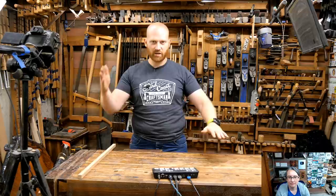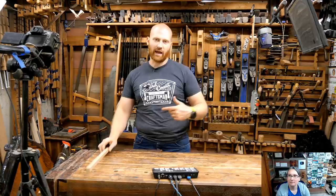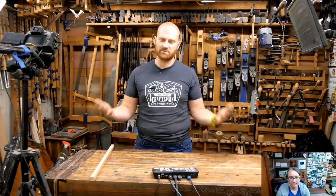And then you put stickers on top of the wood, and then you put wood on top of that, and stickers on top of that wood, and wood on that. That way you separate all your wood by the thickness of your sticker, and that allows air to go all the way around it. If you're in an air-conditioned open shop like where I'm at, it's not really necessary, and it's not as much of a problem, because I have almost the exact same humidity and temperature in here all year round, so it doesn't make a whole lot of difference for me.